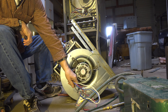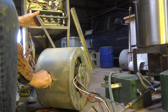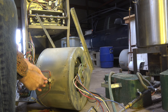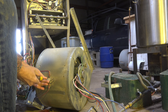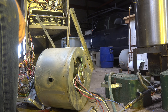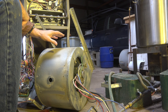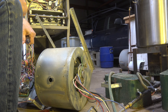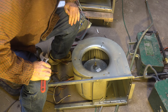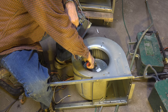You'll notice the fan motor has already been disconnected. Also, on the bottom of the blower assembly there's another high-temp limit switch — I'm going to take it off but leave it wired up. Now I've got everything ready to disassemble this blower assembly, get this motor out, and replace it.